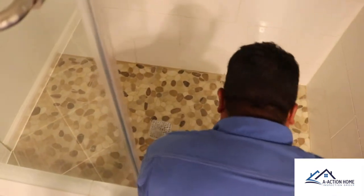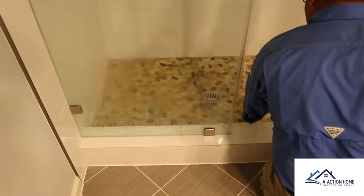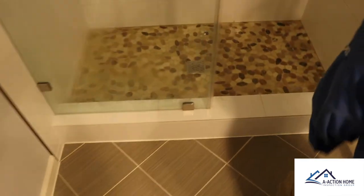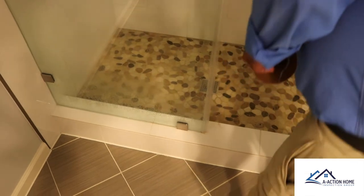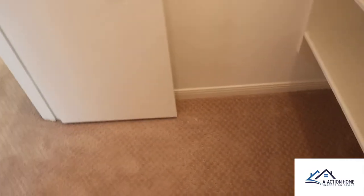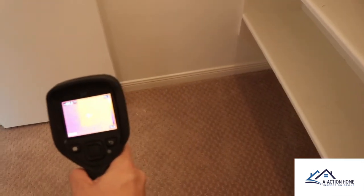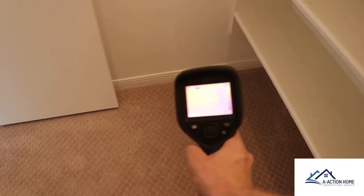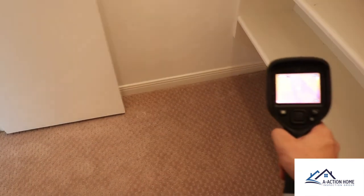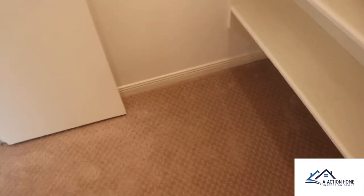Robert is removing the shower drain stopper — we're going to let all the water drain out, then come in behind it to check for any water penetration underneath using the thermal camera and in the adjacent closet. Right after touching it and scanning with the thermal camera, it doesn't show up very well — you'd look for blue marks indicating cold moisture. This is one of our cheaper thermal cameras, but it still gets the job done and will detect moisture penetration.